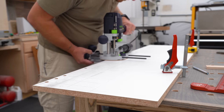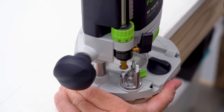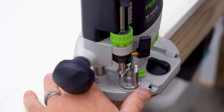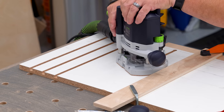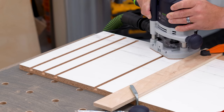This does two things. It gives me an entry point for my dovetail bit, since dovetail bits aren't very good at plunging, and it leaves a small amount of material in front of the clamps so that they physically will not be able to slide forward and into the blade's path. To cut the dovetail slots, I'm using this dovetail bit from Microjig. A regular half inch 14 degree dovetail bit will work as well, but the Microjig bit is shaped a little bit different, and it rounds the hard corners off in the bottom of the dovetail and on the top, which means less sanding and refining of the dovetail groove on my part. I used the holes that I had previously drilled to set my plunge depth, and used a shop made T-square to start routing the left to right grooves in the sled, starting at the relief holes and then moving forward. One thing that can make a big difference in the quality of the cut is to make a clean up pass simply by running the router backwards through the cut you already made. This will sever the fibers that didn't cut cleanly the first go around.